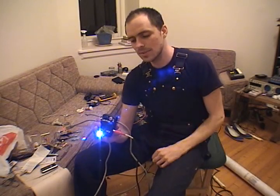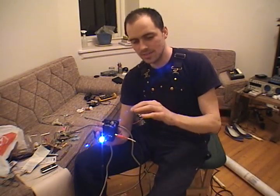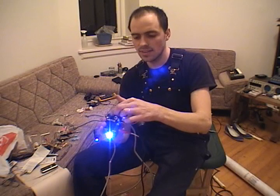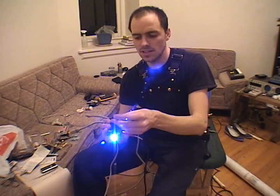That's always on — you want to use that mode to hook everything up. Hook the camera to the computer and make sure it's in always-on mode. Once everything's set up and the feed is going to the computer, switch it to switchy mode. The signal will stop and only go through if the push-button switch or anything else with low resistance is hooked up to this RCA jack.